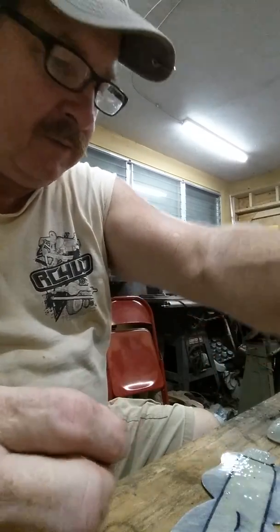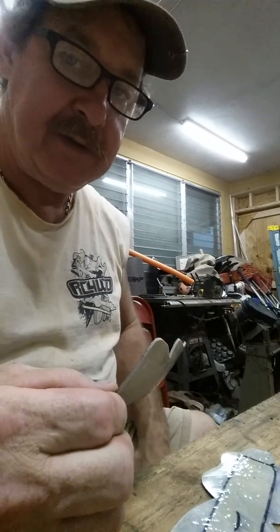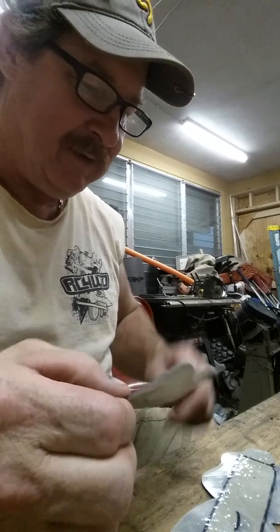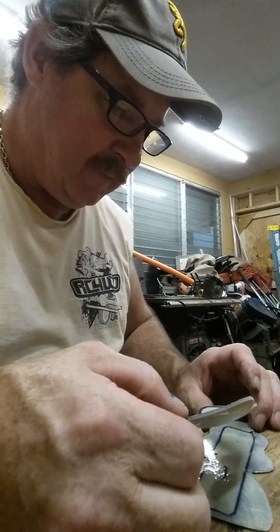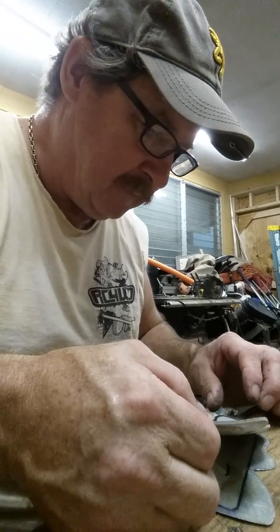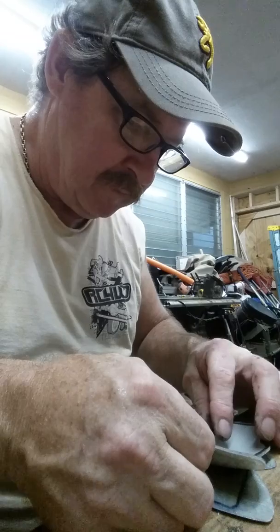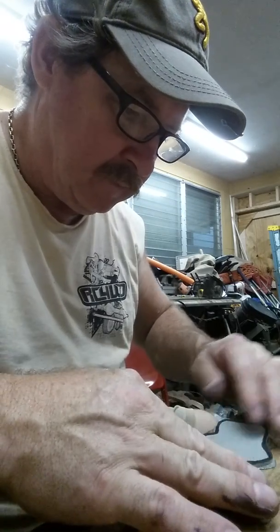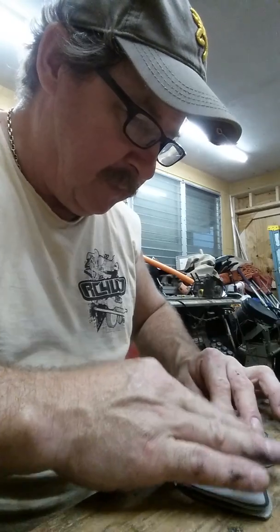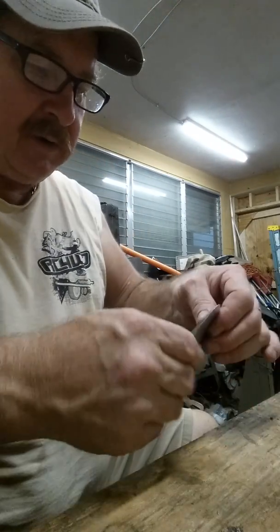Yep, we're close. All right, now one thing about contact cement, you only get one shot. So you have to make sure you're pretty close to it and ready to roll. Otherwise you'll be ripping it all off and doing it again. Just make sure you press it down good everywhere.